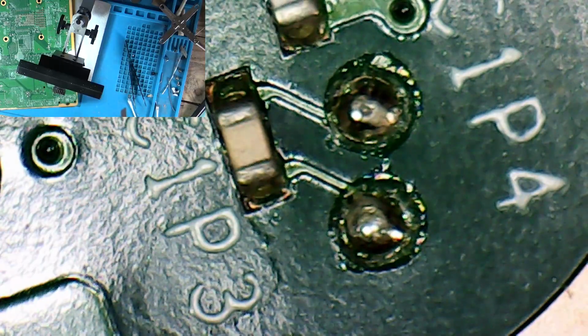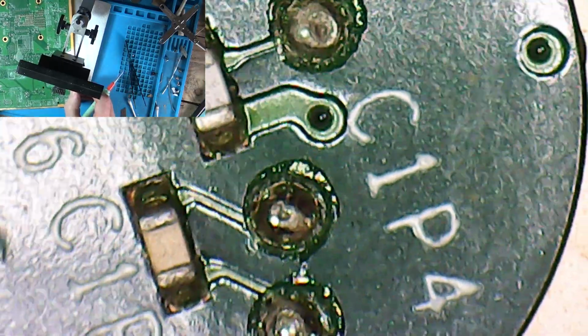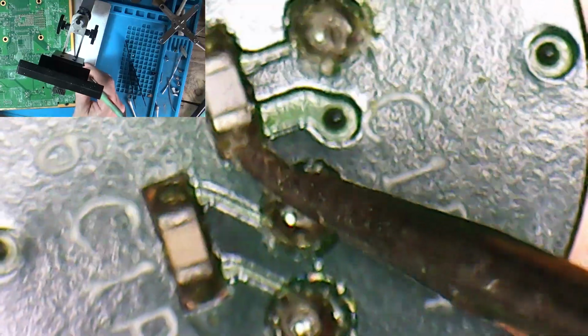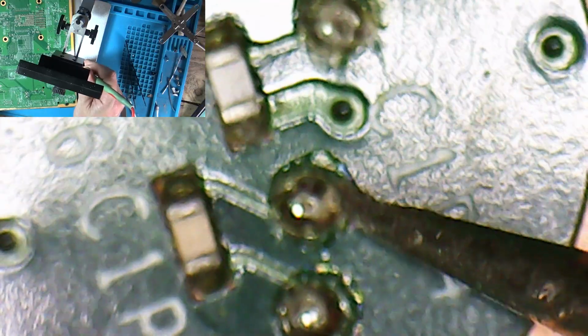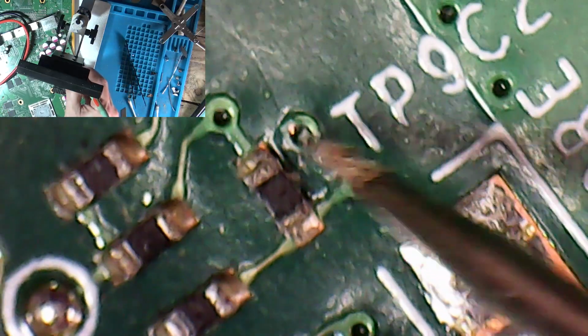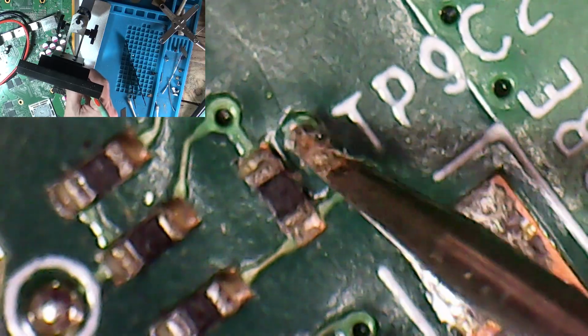Let's have a look on another board. Right, on another board, the same area. This is a spare board, so no guarantee this is right. That is showing to ground. But no, it shouldn't be. There can't be the right holes in. Oh no, hold up. That is ground on there. That is ground. I thought that was connecting to the resistor, but it's not. I'm zoomed right in.